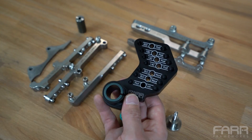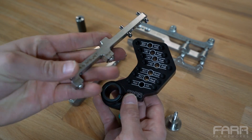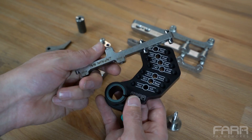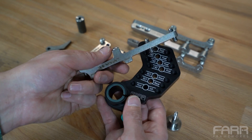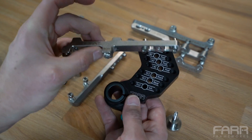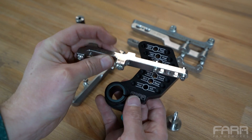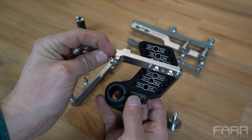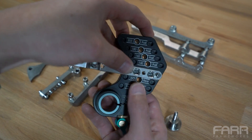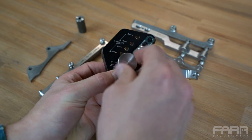The brackets themselves just slide out of these little precision pin-and-slot dowel pins. If I need to change to a different bracket — let's say I want to put on this IS — the IS is actually a flippable bracket, so front and rear are slightly different on the frame. This bracket allows you to do both of those standards, and whatever text is facing up on the tool is the one in use. So right now I have IS mount front, placed on the front pin and slot. Flip the tool over and reinstall the thumb knob.